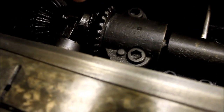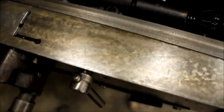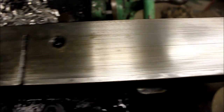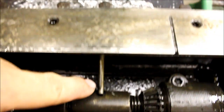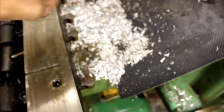The table itself — the ways — I don't really know how to tell what's good and what's not good, but I know it's not good when you can't see any of the scraping marks. Let me see if I can get that focused. You can see some of the scraping marks, but on the very end it's grooved and very much worn down — it's the same on the other side. Also, this oil cup feeds the lead screw nut. If you're at the back of the machine standing by the knee wheel, it's the second one over.